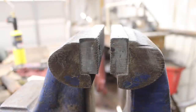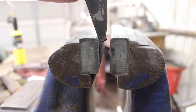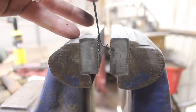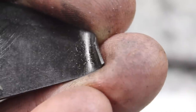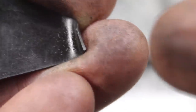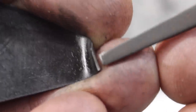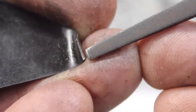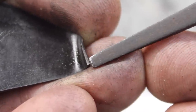Always an opportunity to check the grain structure on your steel. My camera says it's focused but I'm not sure. Anyway, that grain structure looks great — no distinguishable grains. So that's a success.